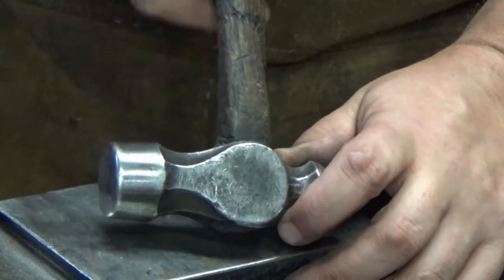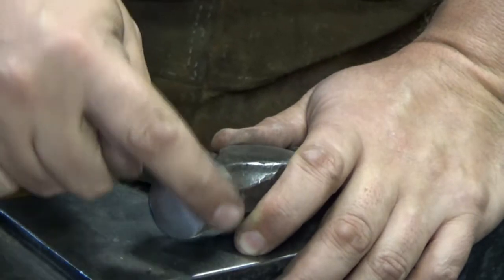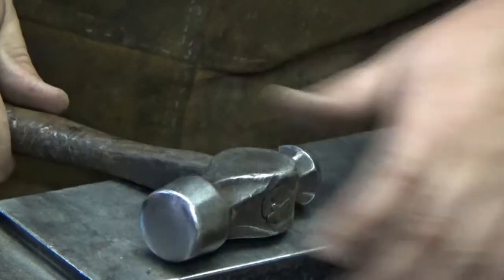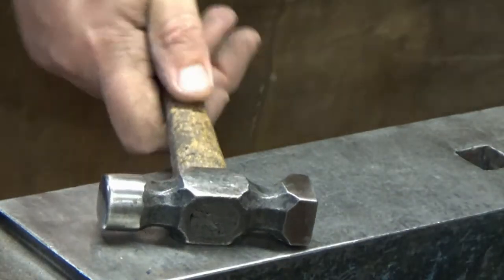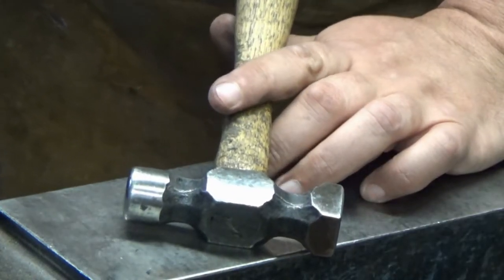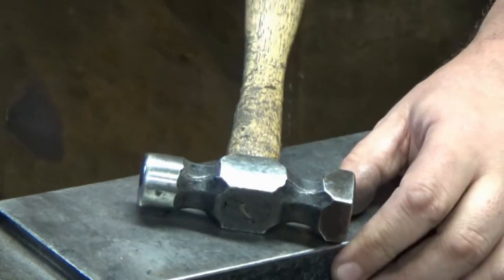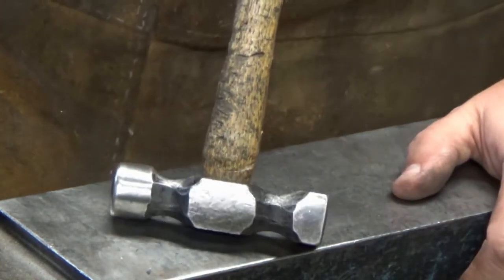The only thing I find with ball-peen and similar hammers is that because they're a little bit heavier and smaller, if you're not paying attention you can be putting in more dents than you want. Another vital thing: just take a grinder or some file paper and lift the sharp edge off. I'll do a piece on how to modify hammers later, but you just want them ever so slightly curved — you certainly want to get rid of the straight edge on the face. You don't need specialist hammers; any hammer you can find will work, you just need to be careful.